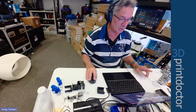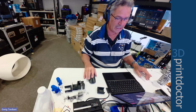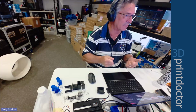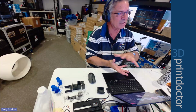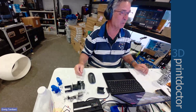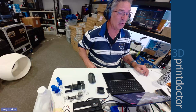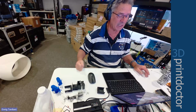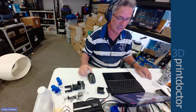So your little issue was an interesting one. It's a matter of persistence. Heat the bed up again, I think, is what ended up working for you, Danielle. And it then just gave it enough flexibility or difference in the two bodies. One was expanding a bit more and then it can crack off. But yeah, it's one of those wacky little challenges that occasionally you get stuck with. If that ever happens and you just can't get it off, get on the MTA and get them to send you out a new build plate, would be the other way that I would be asking that one.